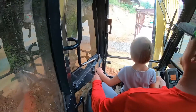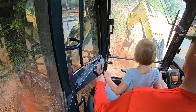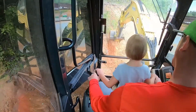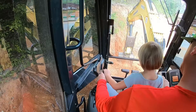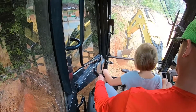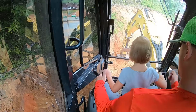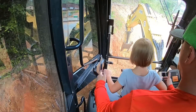A little more practice. All right, now let daddy do the scoop. See how I do multiple controls at one time? You do it now. Pull this back and you've got to push forward on this — see how it came out of the dirt. Push it back forward. Now as you pull back on this one, you've got to push this one down. Pull back. See how the boom stopped? We got help to cut by curling that bucket — so pull your bucket in towards you. Use your power. Stop. Now pull it back towards you as you curl. Use your breakout force.